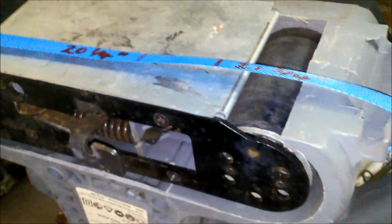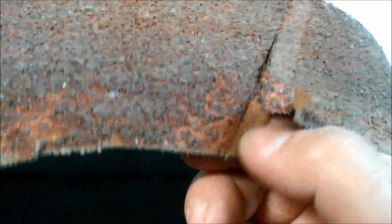Now I'm going to go ahead and actually make and glue a belt, shorten it from one of these old ones here. Now I've just started slowly peeling this. As you can see, there's probably about 5 mil, 5-10 mil overlap there. So I'm just going to slowly peel that away, so I don't have to scrape that sanding paper off. But if you can't do that, you just have to basically get the same angle. I don't think it really matters, and then just scrape away the sanding material or whatever's on there, just so you can bond it better. You only need to do one side.